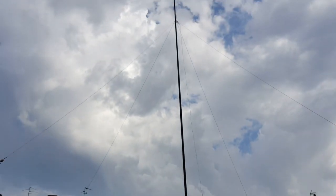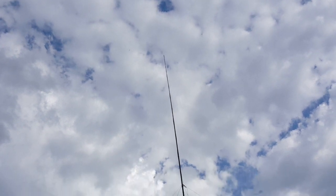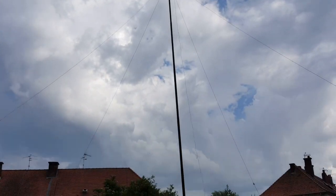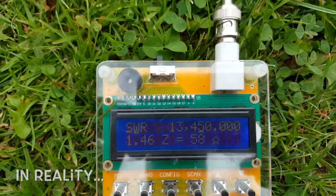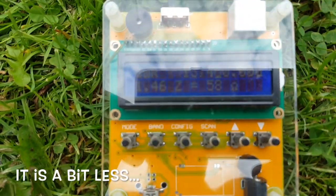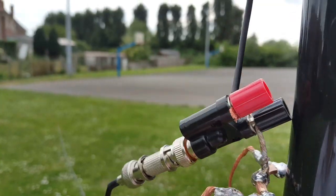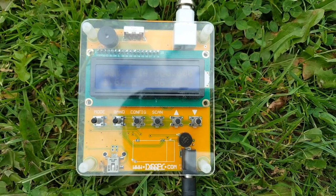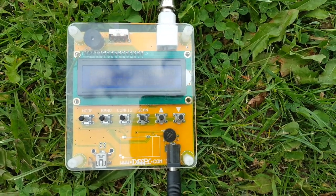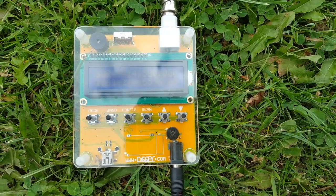Pretty darn nice, but there is some thunder and this might be a short experiment — hopefully it won't end up in the found footage category. The antenna analyzer shows a resonant frequency of 13,450, so I know my wire is a bit too long. I cut a foot out of it and now it's 14,580 — so I should have taken off six inches, not a foot. I'll have to add six inches back later, but right now I'm just going to use it as is.